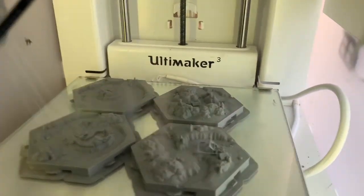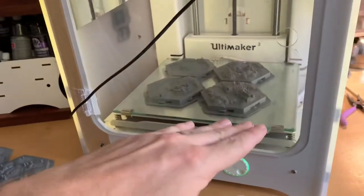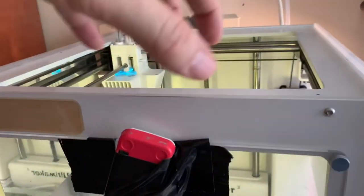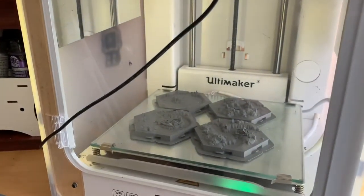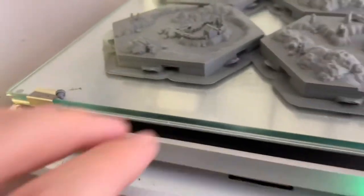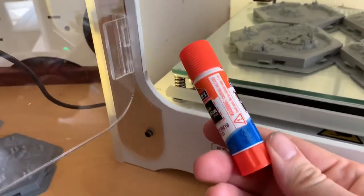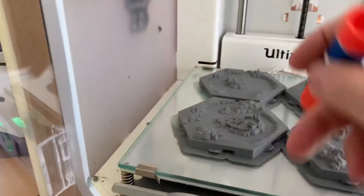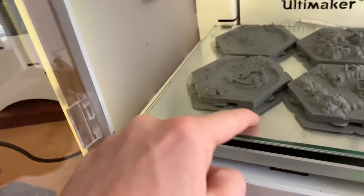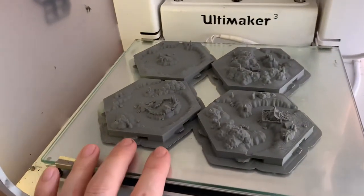The back side of the glass bed stays at a constant temperature, but the front side — especially when the bed plate is lifted — gets cool at the front. One thing I do is use a Raspberry Pi camera just to watch it from anywhere in the house. The second thing I found, especially with these prints, is a new technique that worked really well: I took standard washable glue — the purple glue stick — and rubbed it on the glass bed right before printing, especially around the side that had that curling. The prints stayed really flat and well adhered.